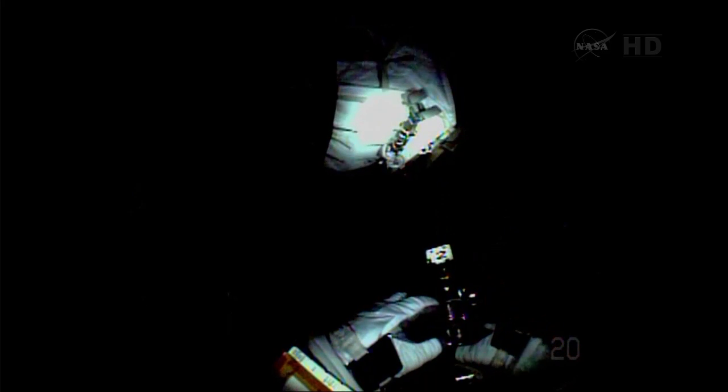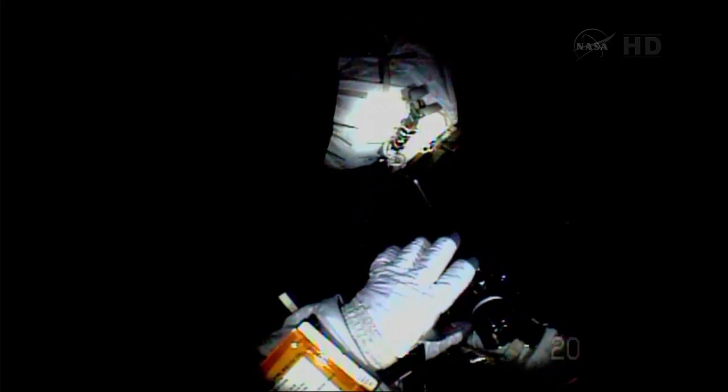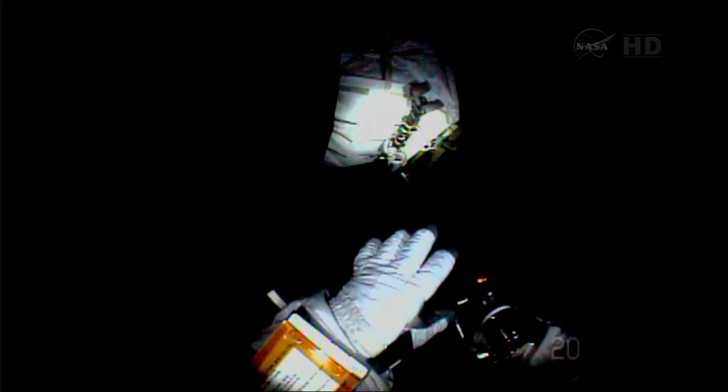Hey, Chris, here we go. I'm ready for you now. We're going to go Bravo 2, counterclockwise 2, take it all the way out and do an inspection on both sides, and then we'll drive it in at Bravo 1 clockwise 2. Okay. Bravo 2, counterclockwise 2, demate it and inspect the threads. Good read back.